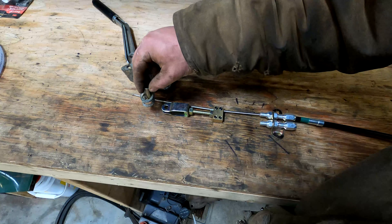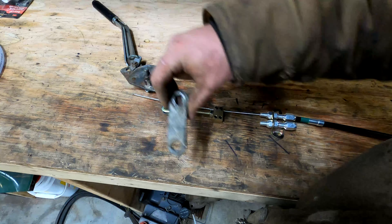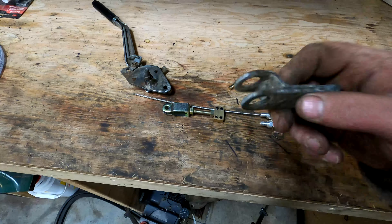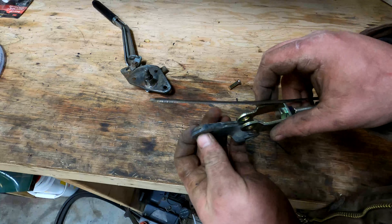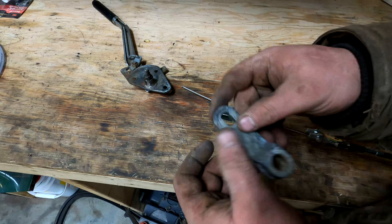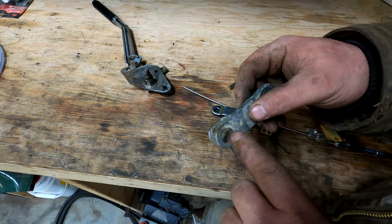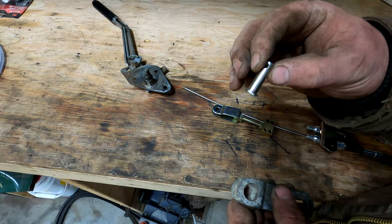Now as you can see, it's that lever. The hole's just a little bigger than the pin. This piece is sized just about perfectly to fit over that. So what we're going to do is we're going to flatten this out, take this bend out of this piece, and then plug weld the holes shut and re-drill it for this sized pin, which I think is 5/16ths.